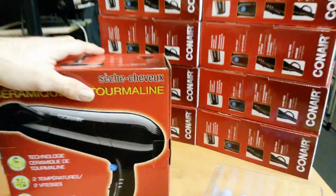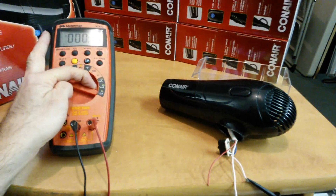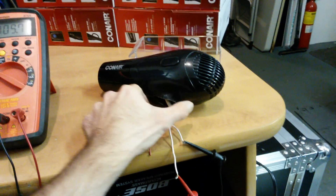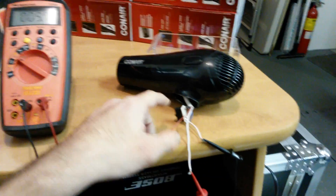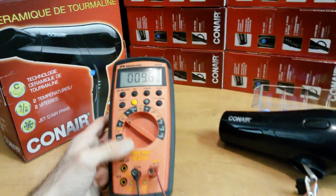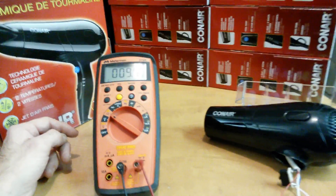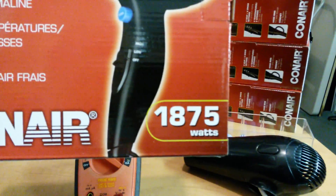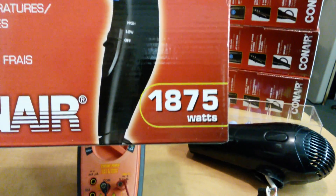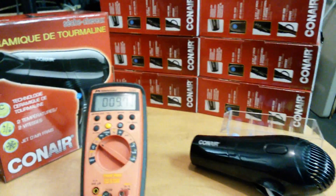You can buy up to 10 of these. When you disassemble them, put a multimeter on and measure the ohms. I removed the handle on this one and measured directly at the high heat setting and you get about 9.6 ohms. If you combine about 10 in parallel you get about 1 ohm, and at 1 ohm and 100 volts that's about 100 amps, which means about 10 kilowatts. If you have 10 of these you get about 18,000 watts of load, which is awesome for the price — all these hair dryers cost me about $80.